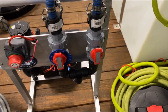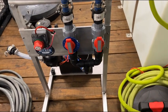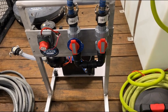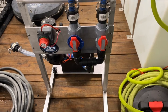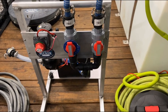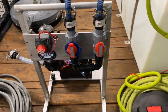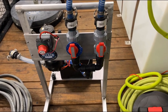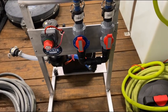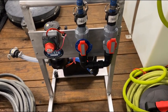And I really don't care, because as I teach at my school, guys, the phrase I want them to get embedded into the mind is all the bleach is doing is changing the color of that algae. So I want to use the weakest mix that I can and still get the color change of the algae on the surface, but not be too strong to where it could cause oxidation of painted surfaces or vinyl or whatever. So it just takes time and experience using it to dial into what you want to use as you go across different surfaces.